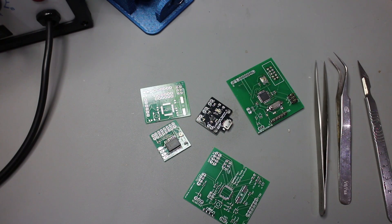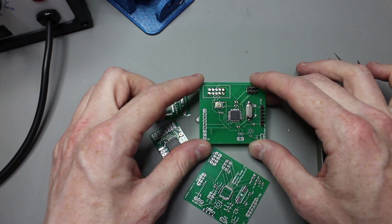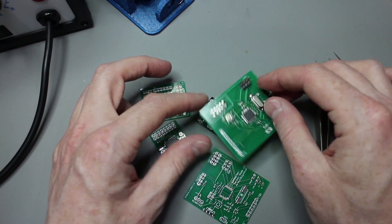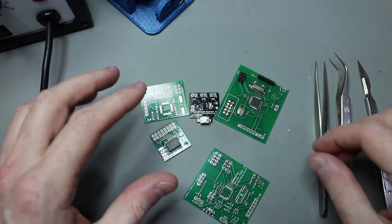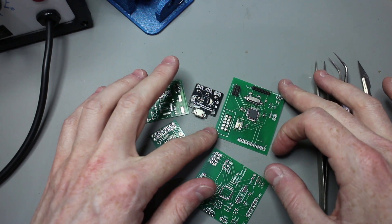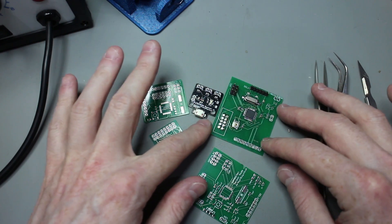Over the past month or two, I've been putting together a number of small boards, primarily with surface mount components. I've gone down this route for simplicity, size of the overall parts and packages, and price. Through-hole components certainly seem like they're easier to fit and put together, but if you can get the right technique for surface mount, it's definitely the better approach. It also makes it feasible to roll out this design for surface mount production line work if it ever reached that stage.